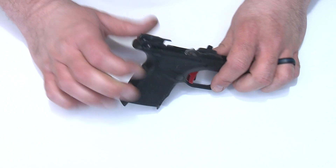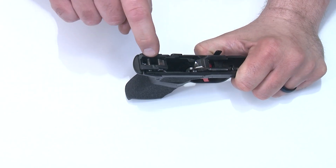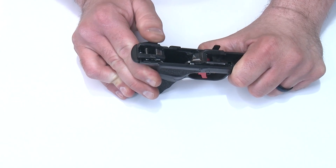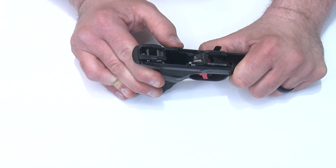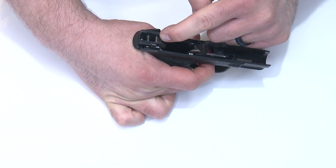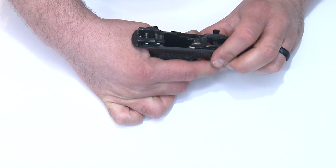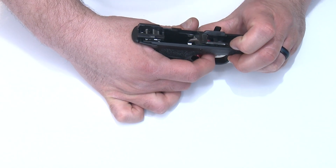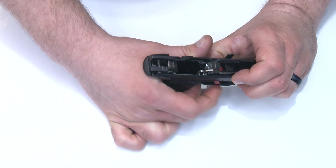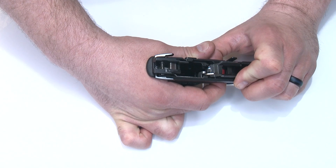For those with the thumb safety model, go through thumb safety checkout first. Pull the trigger body forward and hold it to tension the sear, then articulate the thumb safety up and down a couple times — it should lock in place and lock down. With the safety up, pull the safety on the trigger first, then pull the trigger body back; the sear shouldn't move far enough to tilt down — that's what we want. Safety down, pull the trigger, and the sear articulates all the way back. This is normal function: safety off allows firing, safety on prevents sear drop.